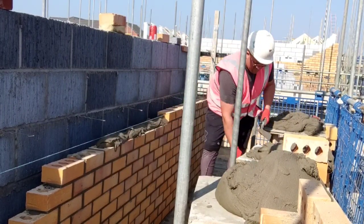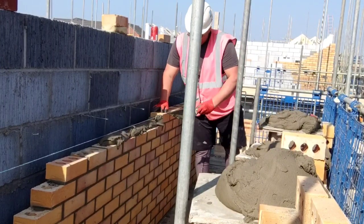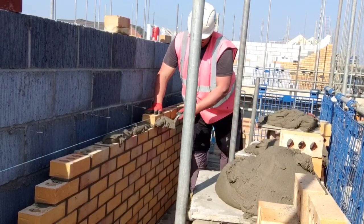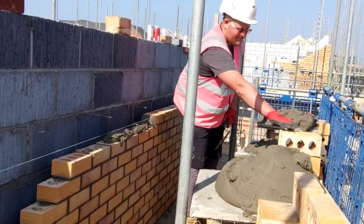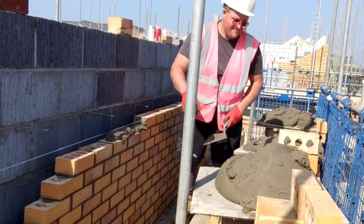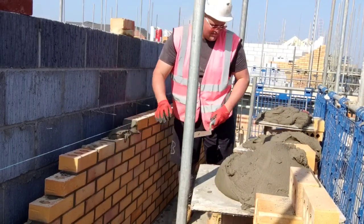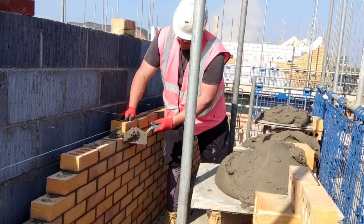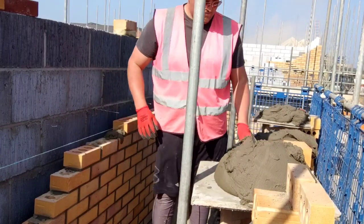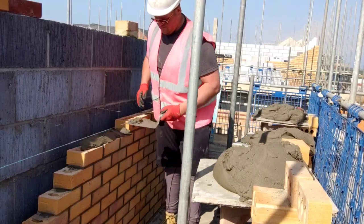So as you can see here, I'm doing the tailing out a large corner, but instead of, say, tailing out 12 bricks each side to make a 24 course corner, I tail out probably 25 bricks, at least, one side, and then I'll rack back maybe 12 or 13 around the opposite corner. So I do like an elongated corner, just so I can hit gables in two runs